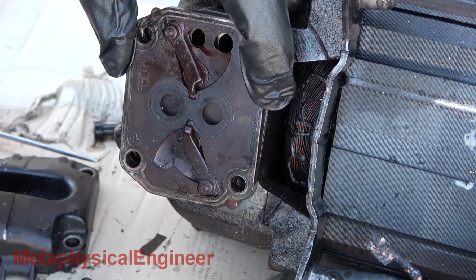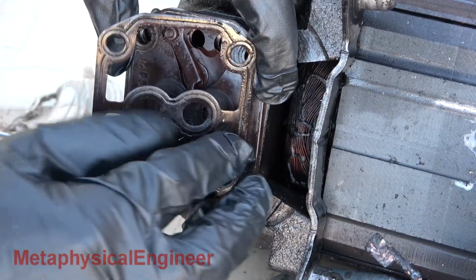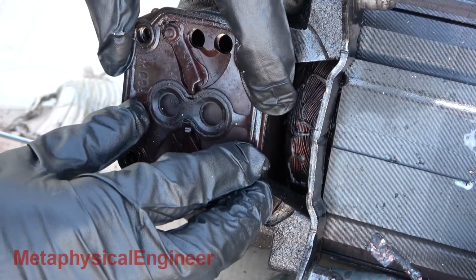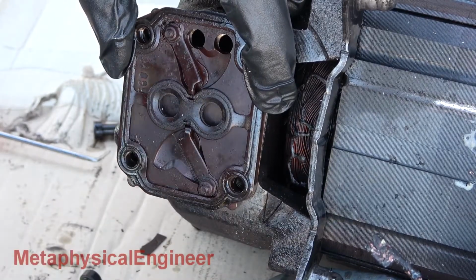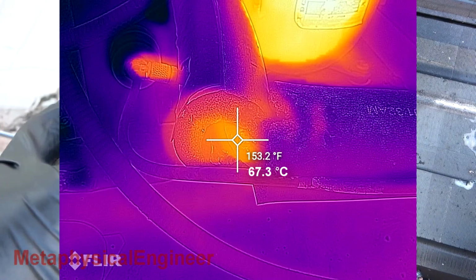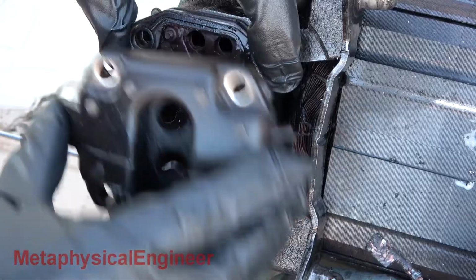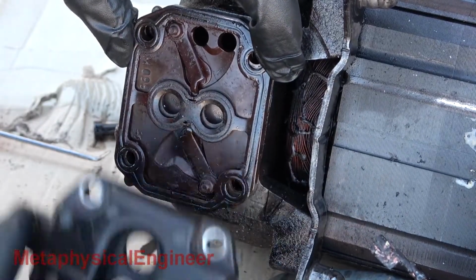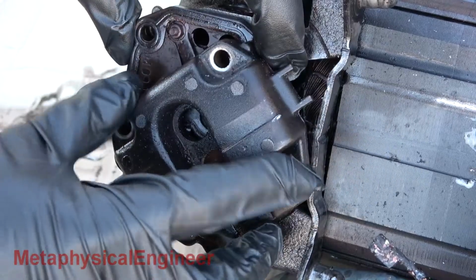Overheated springs lost temper, and carbon fouled the seats, so valve sealing deteriorated. That blown-out gasket also let discharge gas leak back, accelerating the problem. The suction line would go from cool to blazing hot in seconds when the compressor shut down from all of the hot gas leaking back. The overload protector saw reduced current, so the compressor rarely, if ever, tripped out, and instead kept running and burning.